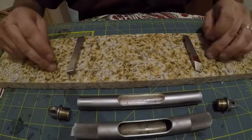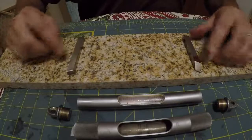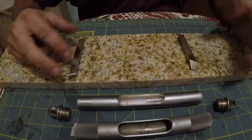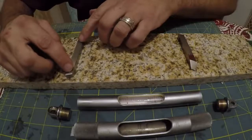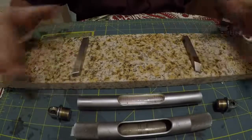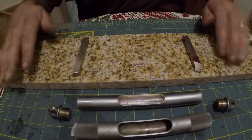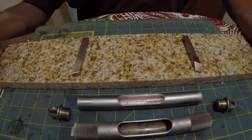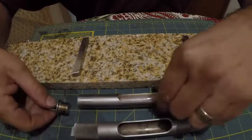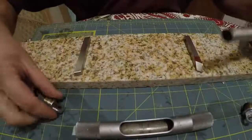So that's what I've got my poor man's surface plate here. This is just a piece of granite backsplash, but I've got that and a couple of, you know, these are ground tool bits. They're pretty good in parallel, and, you know, they're not rocking on here. So this should work good enough for this job. They recommend doing it on like 1, 2, 3 blocks on a surface plate, but, you know, not everybody has that. Certainly I don't.